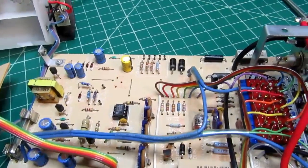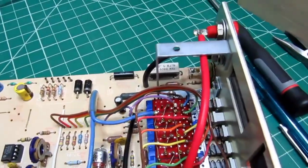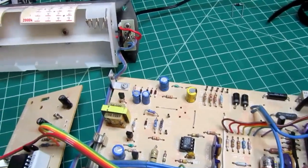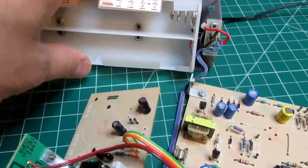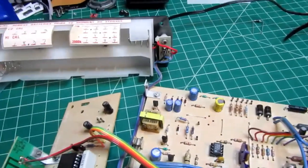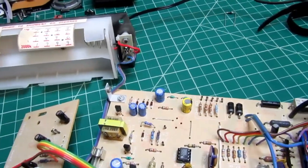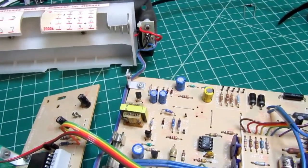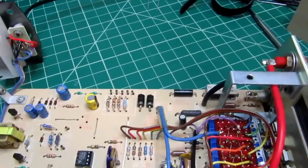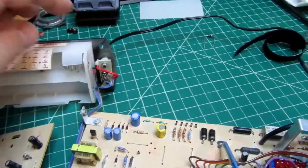the circuit is probably going to be using a plus and minus or bipolar power supply in at least some parts of the circuit, and I'm going to say that it's probably something less than 9 volts, because the batteries would generate about 9 volts, and the AC power adapter is also looking for 9 volts. It's going to assume those are not regulated, so it's going to regulate that down, and we'll find out that the actual regulated voltages are probably somewhere between 6 and 7, maybe 8 volts, probably in the 6 or 7 volt range. Again, I'll verify that when I get to the schematic. But it's only a positive voltage being produced by the batteries or by the AC power supply.